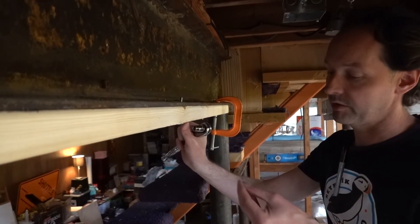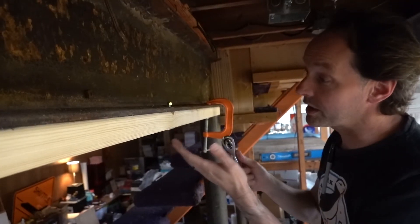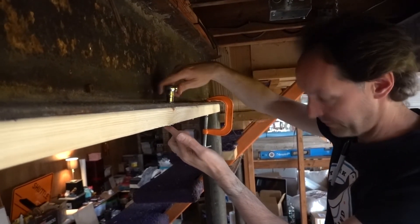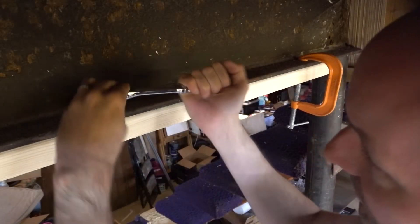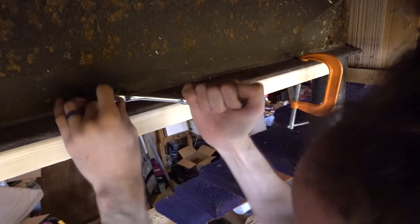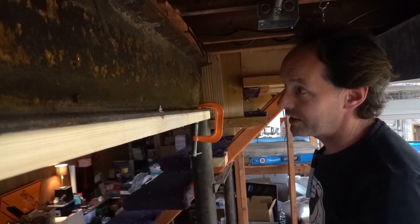So that won't leave — put a washer on top. I'm using a nylock nut. You don't have to, but I am. It's a wall; I like some sense of permanence. Normally without the torque washer this would be really hard — you'd need pliers and it'd be a pain. But with the torque washer, as long as I keep one finger in there to keep it lined up, I can ratchet right down on the nylock and my carriage bolt won't spin in the hole. And we'll just wrench this right on down — yeah, that's super tight. That is the way.